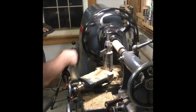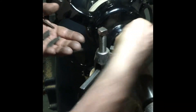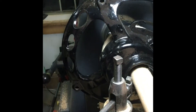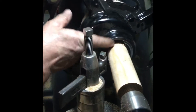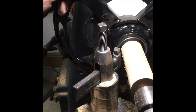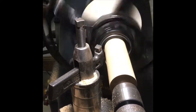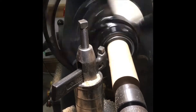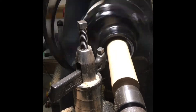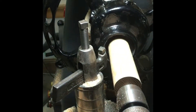I'm trying to fix this end bell. You see these little pieces of broken cast iron — they've smashed out of there. Inside that's hollow and there was a little cap that kept the oil in there. I'm going to bore that to a nice press fit and do a new one of these. I'm holding this on just a wood chuck and I'm hoping not to mess things up. I'll clean up the shoulder and press fit a piece of bearing bronze ring with a beautiful little logo. Wish me luck.